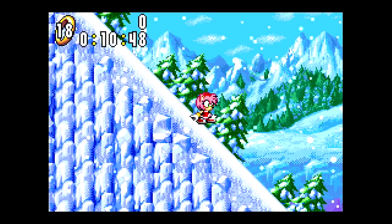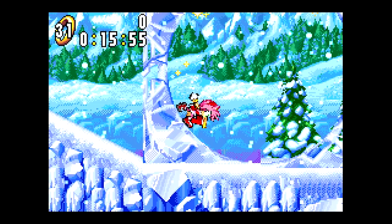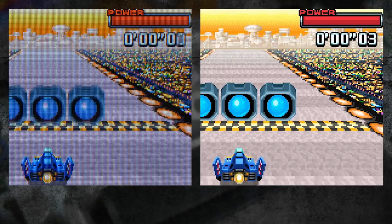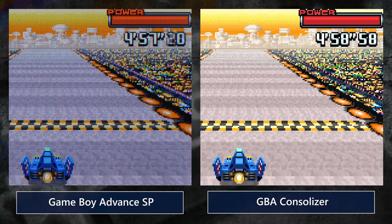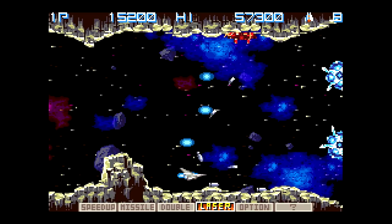Always remember you'll need a low-lag display to take full advantage of that. This speed discrepancy can be a problem for some people — even if the difference isn't humanly perceptible, the consolizer gains only about 1.5 seconds over the course of 5 minutes — but it might tip the scales away from authenticity for speedrunners. The consolizer board actually has a solder jumper that can be closed to allow running the system at its original speed, but Woozle feels this feature needs more testing and is not yet offering a 59.7Hz firmware. He also noted that the consolizer uses a very high-end oscillator, running at a more precise frequency than even the stock GBA oscillator.